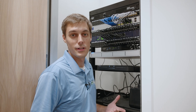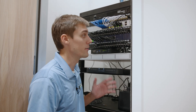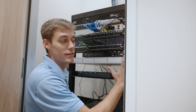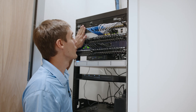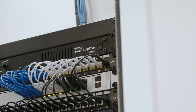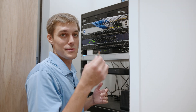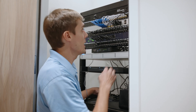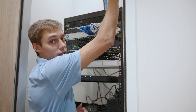So here we are in one of our closets. This is still a work in progress — I haven't managed the cables in the back, so you see a lot of extra power cables hanging off — but I have patched everything in so you can see the layout and the way we do things. There's a reason behind pretty much everything that we do. On the top we have our Rolls 70-volt amp for all our speakers. We put the amp on top because it's the most heat-producing element in here, so your heat rises and goes above everything else.